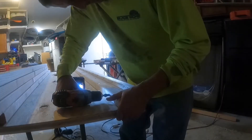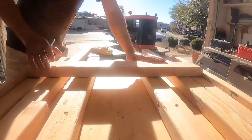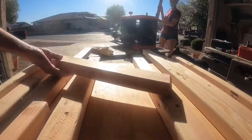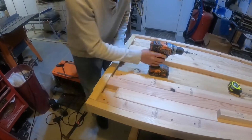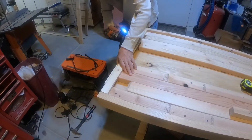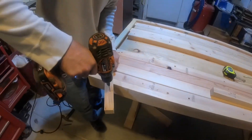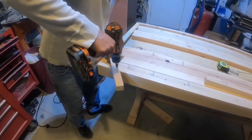I ended up using 2x4s for the side edges of the table, anchoring them to the outer rail using countersunk screws. I made my legs out of 2x4s as well. The upper support of the leg is going to screw into the inner and outer rails of the table and also act as a lower guide support for the extension slides. My original plan was to anchor the outer trim directly to the slides, but that didn't work out too well, so I cut out a piece of 2x2, anchored it to the extension slide, and then anchored the outer trim to the 2x2 — that worked out pretty well. Here I'm pre-drilling so I can screw it to the rail slides.